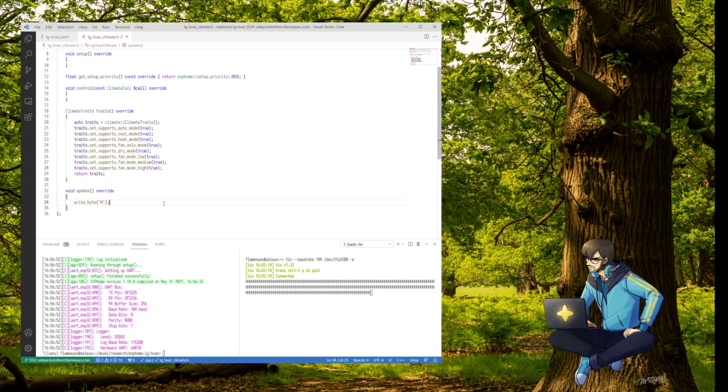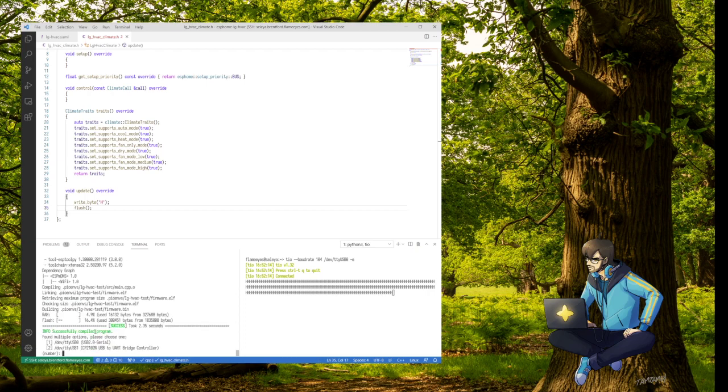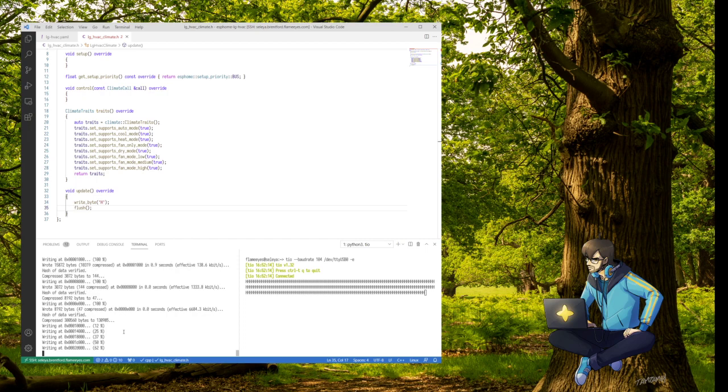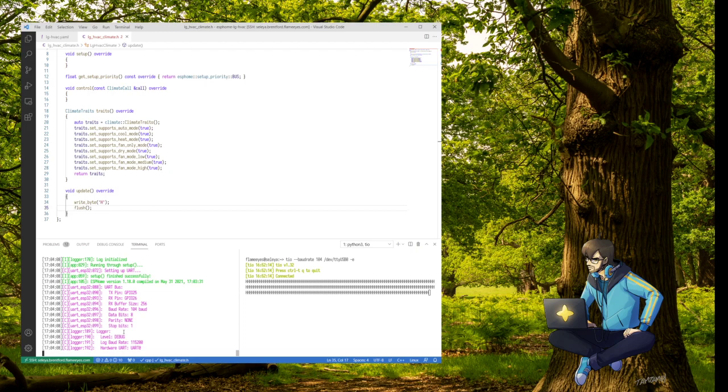Coding, this is my coding, and I'm going to flush right after, because if I don't do this and it buffers more data than I want it to buffer, then I have a problem. And you can see, this was very clear here for me, because I can see multiple H's arriving instead of arriving exactly every 1 second. And it is possible that I don't need to send this every 1 second. I could poll this probably every 10 seconds, I think, because the HVAC doesn't respond unless I send something. But I don't know if that means that it just gets there and gets stuck.